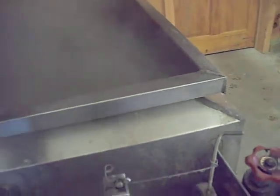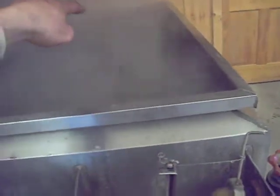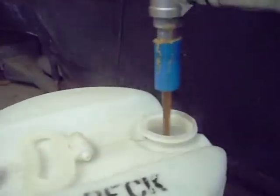The front pan has a flat bottom, and what happens is after the majority of the boiling takes place in this back pan, it's fed by another float, which you can see right there. That's sap being fed into the front pan, and you can see this pan's got a divider right here. The sap comes in, goes to that back corner. The divider has a little corner knocked out of the bottom, and so it runs through that channel, comes up through this channel, across through this pipe here, into this pan, to the back corner again, and then it's boiling. This is almost syrup boiling right here. And you can see there's actually some syrup coming out of the evaporator right now.